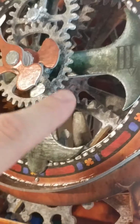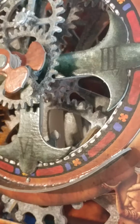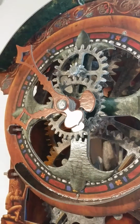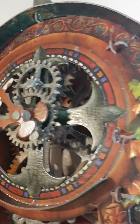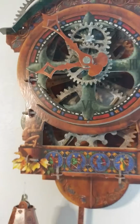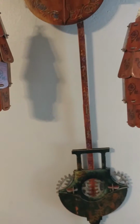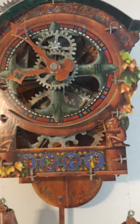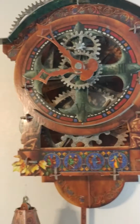I'm still adjusting the time. Since I changed the angle of the anchor back there, it threw off the speed of the clock, so I'm still dialing in the exact speed so that it will keep perfect time. I found some apps that help me analyze the beat of the pendulum and the movement to know if my clock is fast or slow or what's going on. So that's interesting. I might put some links in the description to that.